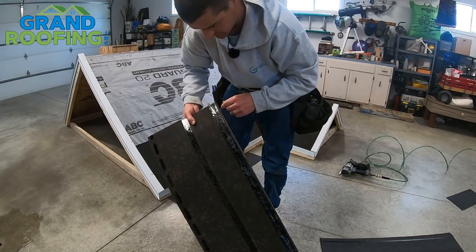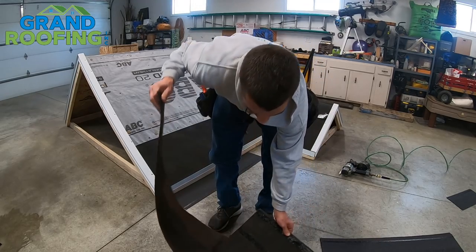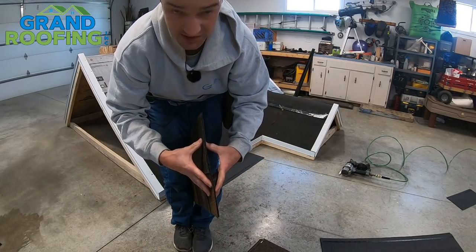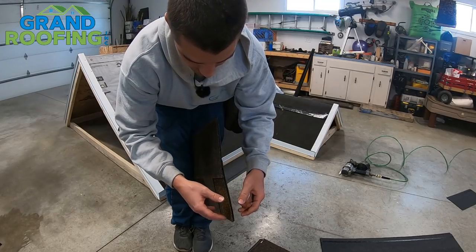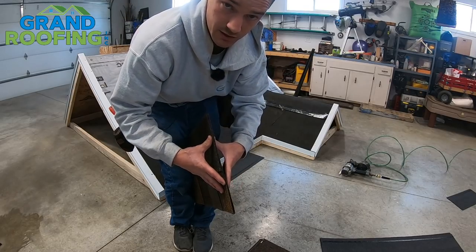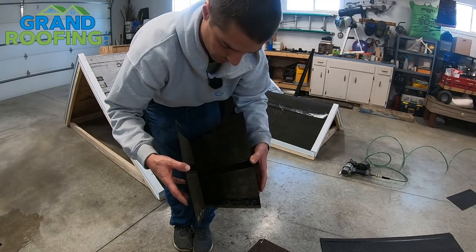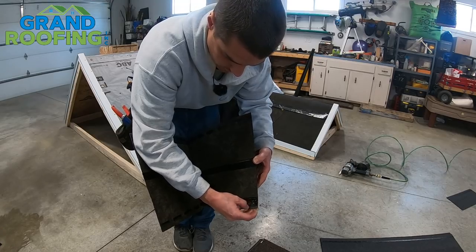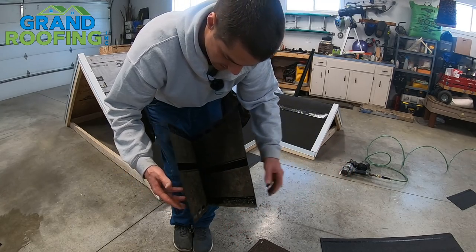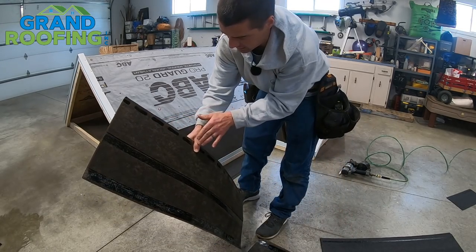Over the years I've heard people say these guys never peeled off the cellophane. This does not need to get peeled off. When your shingles come in a package from the manufacturer, they would stick. The way they manufacture them so they don't stick — the seal strip is lined up on the cellophane, same on the top part. It's so they can sit, be in transit, on warehouse floors, hot summer days and not stick in the bundle and ruin your shingles. Make sure when you're ready to install, there's no cellophane on that seal strip.